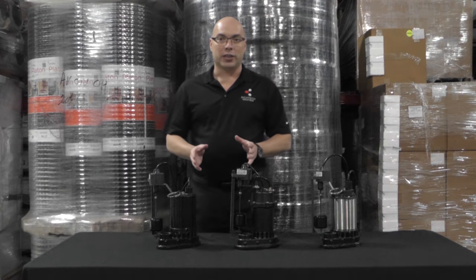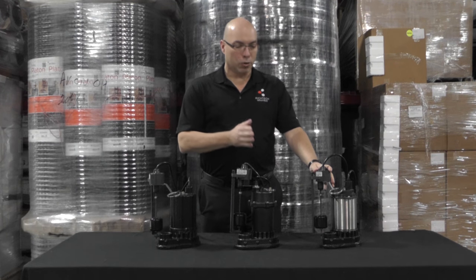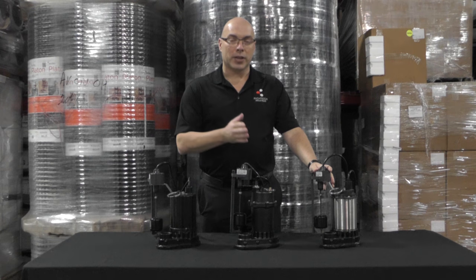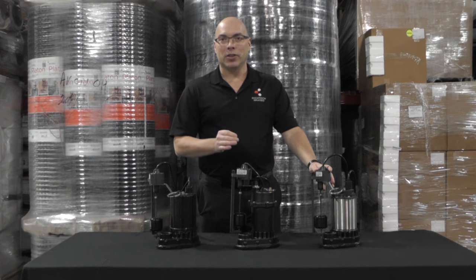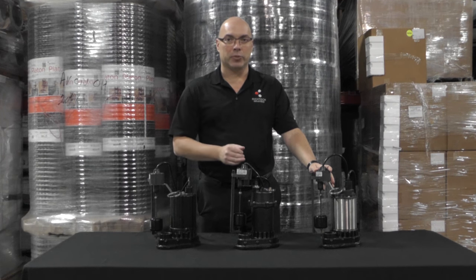The trade-off of a few dozen extra cycles on your sump pump's switch isn't worth the risk of flooding your entire basement. In conclusion, using a higher horsepower sump pump is going to protect your home. The few added cycles during a rain event are a small trade-off to have the extra pumping protection to keep your basement dry.